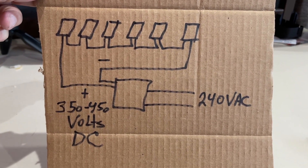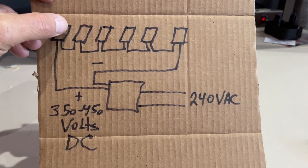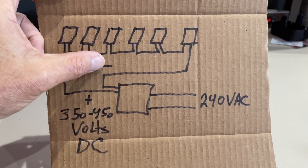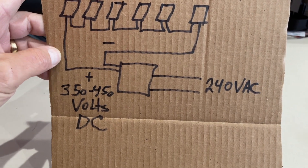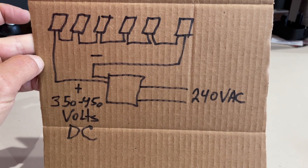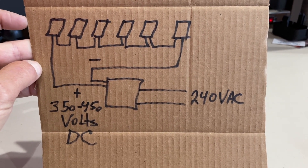Let's have a look at the circuit configuration of my garage solar. What you're looking at is called a string inverter — those are the 10,000 watt inverters. These are 330 watt solar panels. A bunch of them are stuck in series, very much like when you put batteries in a flashlight. It provides a high voltage with a negative and a positive, and it generates anywhere between 350 and 450 volts DC to the input of this inverter. Out of the inverter comes 240 volts AC — the same stuff that runs your house. By installing a solar array, you're able to generate the same power you buy from the grid, but this energy is coming from your own equipment.